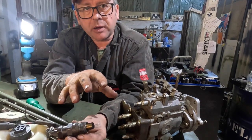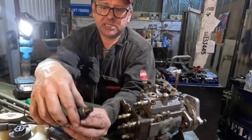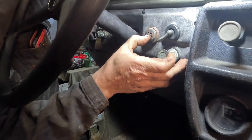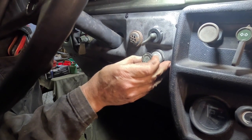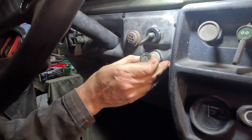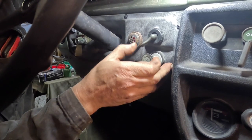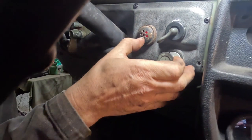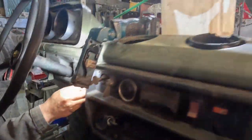There are things called glow plugs, which can certainly heat the fuel and heat the system, which helps. Like I see, this is leaking all over me at the moment. And this is the preheat. So inside of here is a coil of wire and a 24 volt is being passed through that at the moment. And when this starts to glow, that means that the glow plugs are sufficiently heated and we can start the engine. So there we go, you can just sort of see it. The French Army, interestingly, realised that you can take the tops off of these and light your cigarettes from them.